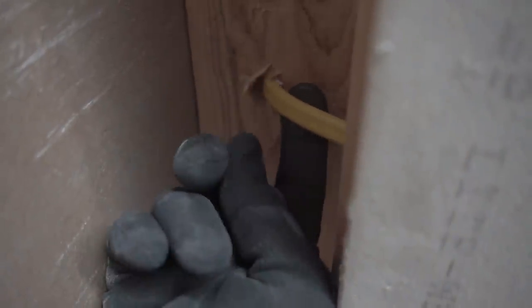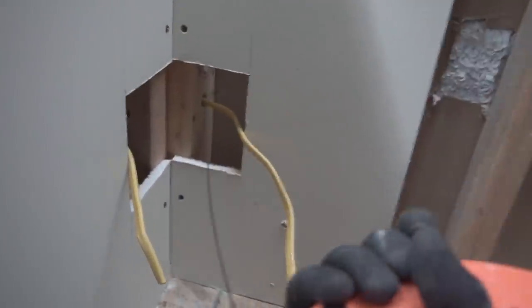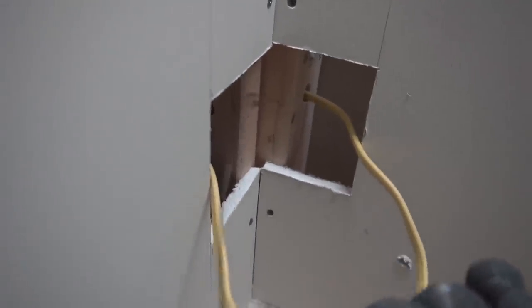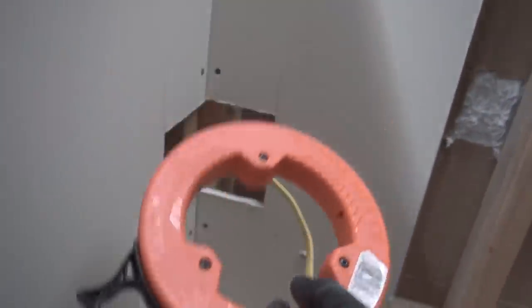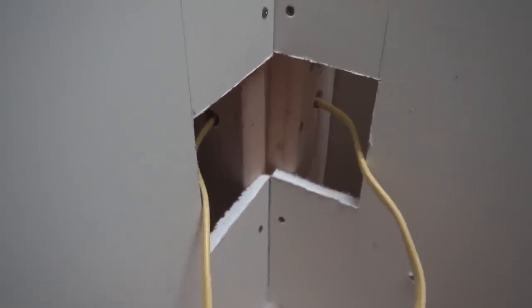Let me take my camera out and show you what's going on behind here. From this mock-up you can see the cable runs through right there. You don't want a sharp 90-degree turn because that will create a pinch on your cable. If there were three more studs built up on each side, you'd have a nice solid tunnel for the wire to run through. If you're having trouble fishing out wire, you can always use your fish tape — run it through and connect it to the end of the cable to pull it right through. All the tools I use in this video I'll leave in the description down below.